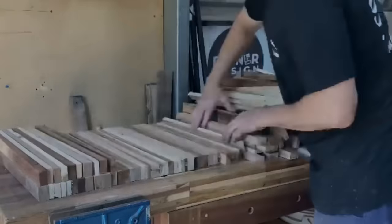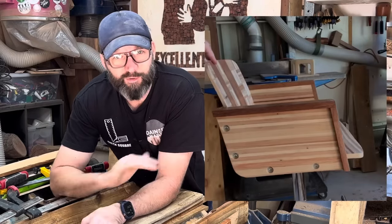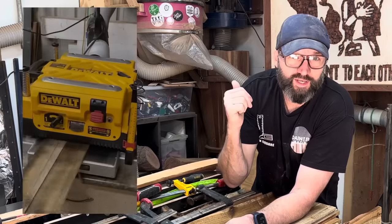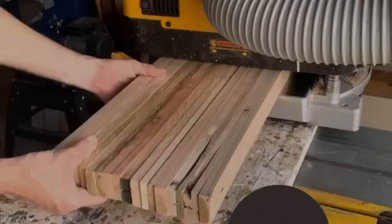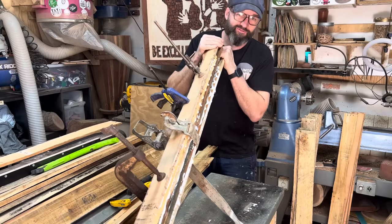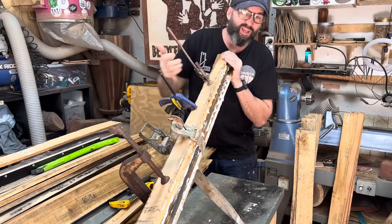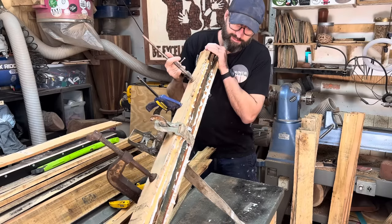From here, I've got six pallets busted apart. I'm going to put a straight edge on every single piece using my straightening jigs that work with the table saw, then clean all the timber up. I now use a thicknesser and every piece goes through it on both sides — I get a beautifully planed surface, a beautiful gluing surface. Although I've just mocked this up for the thumbnail, this looks very much like day-one gluing pallets together. I had old broken clamps, ratchet straps, $2 F-clamps from the cheap store, and craft PVA glue pissing out everywhere.